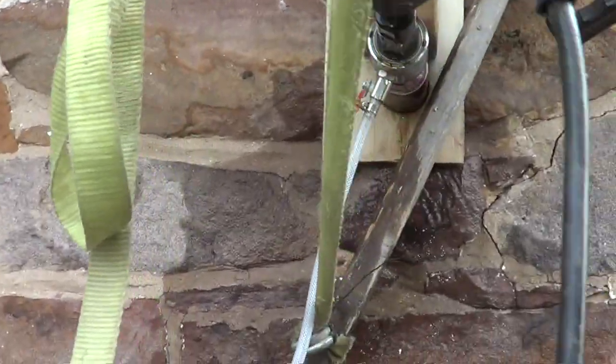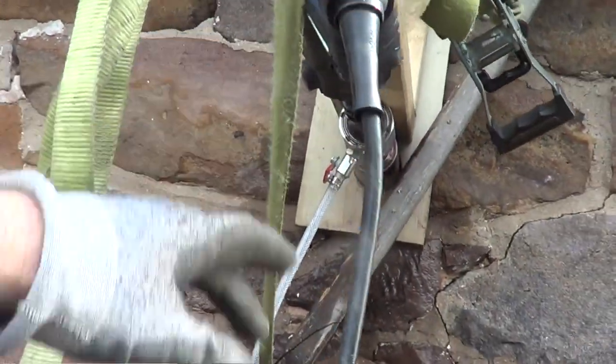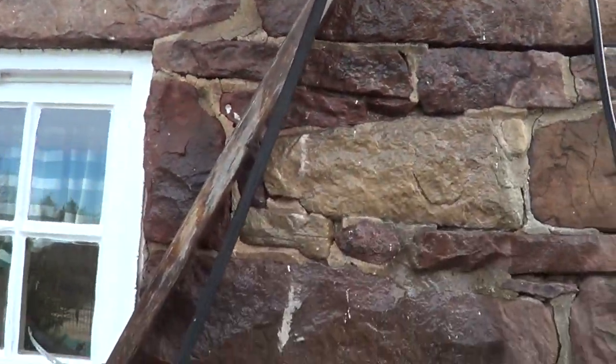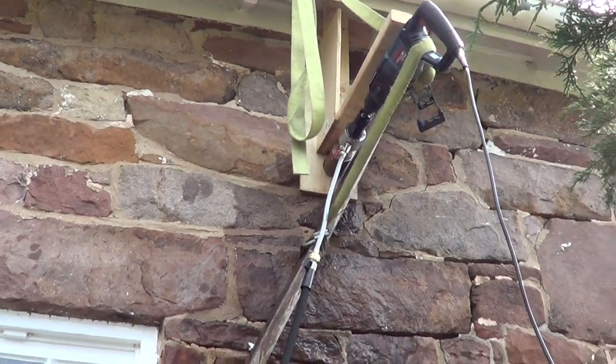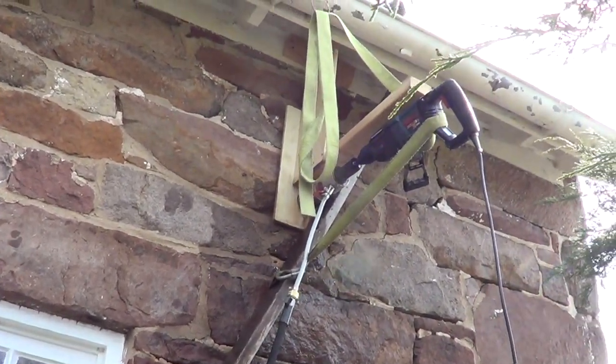The second hole is hitting solid granite, so I doubled up on my strap — makes it a little easier to hold. But I'm looking at three hours on this hole. You're getting this type of core out of it. If I were doing this again, I'd probably recommend renting the coring machine, because it's a lot easier on the arms.